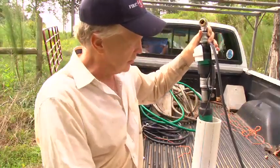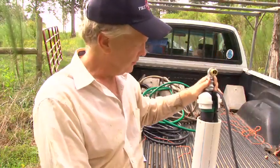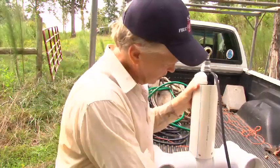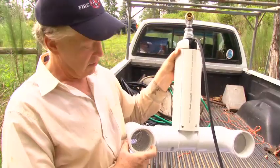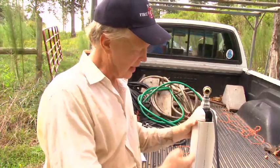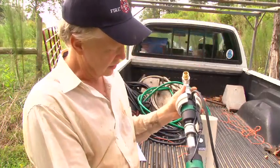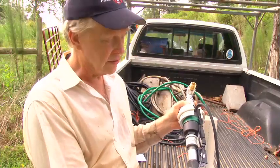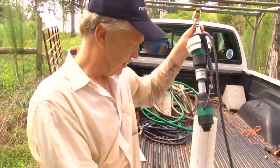This little box is the magical box in the middle that provides a low water shutoff. You can see from the bottom intakes — here's one of them, four all the way around — for water to come into the base, get pulled into the pump, and then up and out. The two pumps we looked at can each do 25 feet; put together they'll do 50 feet, and three or four pumps can go in series to reach 75 or 100 feet.